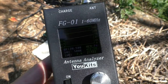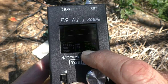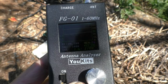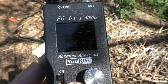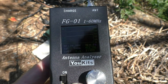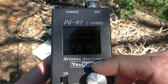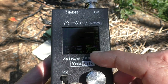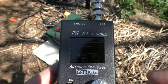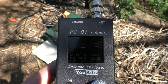Now we can see that on 28 MHz we've got an SWR of 2.4 and the impedance is 122 ohms, so we know the real impedance is about 9 times that — so around 1098 ohms, which is very high. Then at 24 MHz it's 109 ohms — again times 9 is the real impedance presented. At 21 MHz it's 64 ohms.